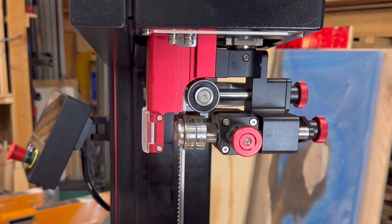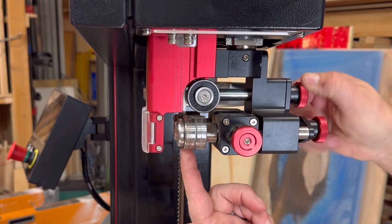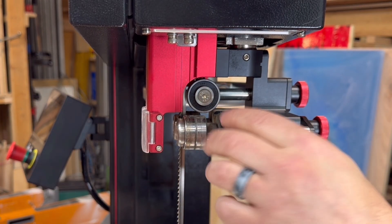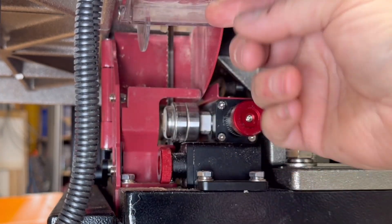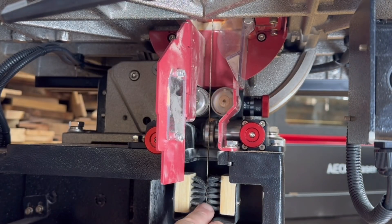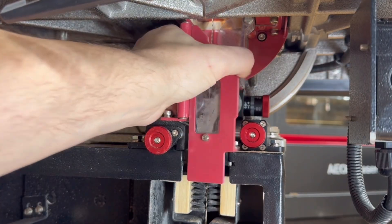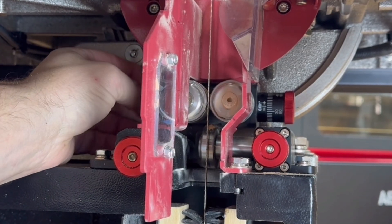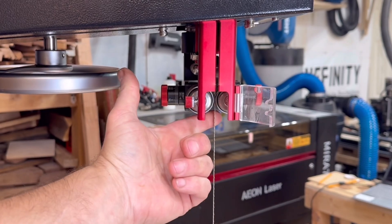Let's talk about the blade guide. I've got a quarter-inch blade on, and it's tensioned. What's nice is that this is all tool-less. The main guide wheel moves forward and backward very easily — easy to see and adjust. The bottom guide also has tool-less control, and it opens up so you can see inside. From the front of the machine, there's a lot of space to maneuver. The dust collection does a really nice job because it's angled. There's about four and three-quarters inches between the bottom of the table and the base — a lot more space to get in, operate, and adjust. You can also see and adjust everything easily there.